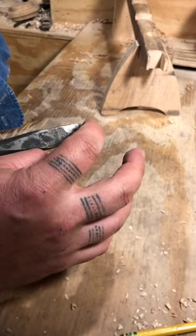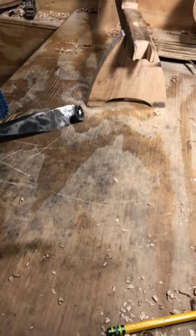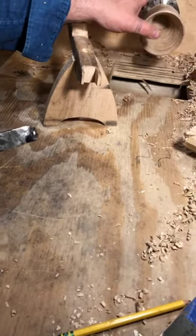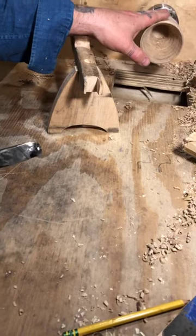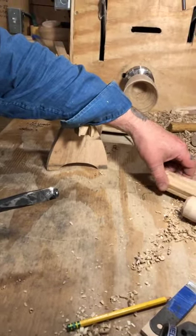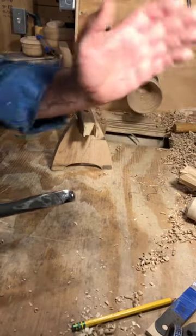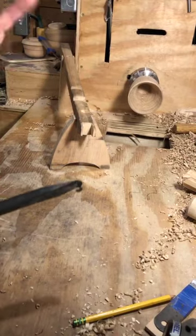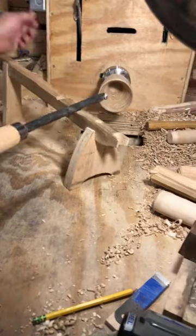And there's a strong bevel on the outside, so I can control it with the higher speeds, 6, 7, 800 RPMs or more. On the pole lathe, you're gonna get maybe 200 max, and so some of those angles aren't as critical. And that bevel thing isn't as critical.